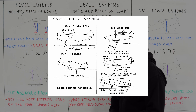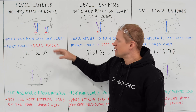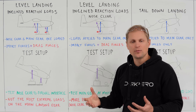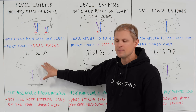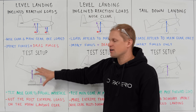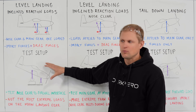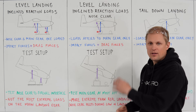We didn't invent this test method — it's based on legacy FAR Part 23 regulations. It's a proven method, but it does have its limitations. The main takeaway from this test is validation of the nose gear to firewall interface. We already proved out the sub-assembly of the nose gear through a test fixture, but what we haven't validated yet is the connection of the nose gear to the rest of the airframe. This test also occurs at the forward most CG position, so we're trying to get as much load as possible into the nose gear. Because we're putting a lot of load into the nose gear, we're not stressing the main gear to the full extent required, so we have to move on to our other phases of testing.